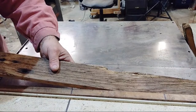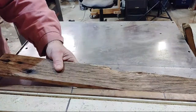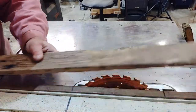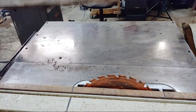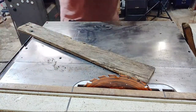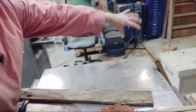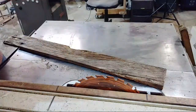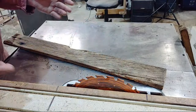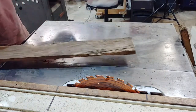The only sort of guard I would fit, I would tell a lie, just not the kind that comes with the saw. You can get a swing guard. A lot of the old saws used to come with a swing guard, where the guard would be mounted somewhere else on the saw, like over here for instance, and you just swing it over the blade. Now, they technically really aren't correct, because the blade has to have the side guards and all that sort of thing. You can't have that with a swing guard. But that's what I'd do.